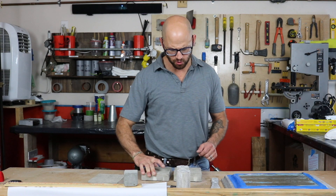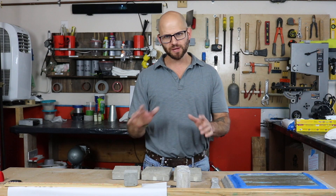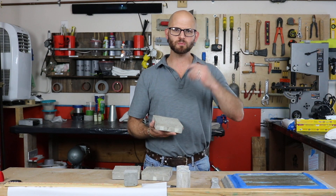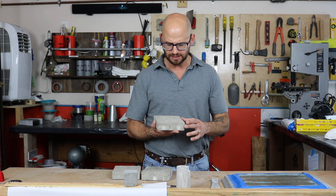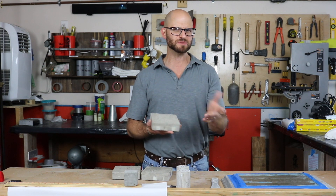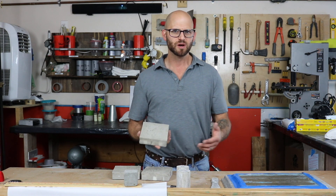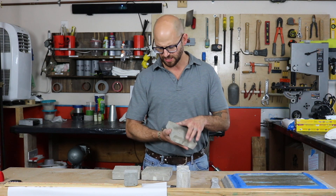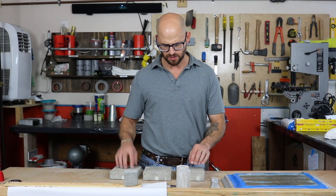Final review of the Quikrete 1106 — it's my favorite Quikrete, not a paid advertisement or endorsement. My chief complaint is you have to put more water in than what's recommended on the back of the bag, and I don't like that. But that's easily solved, and it's something we've found for all Quikrete mixes — every single one of them we've had to add more water than recommended. Easy fix. Of all the mixes, I like the crack resistant the best.